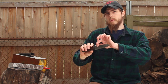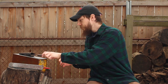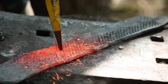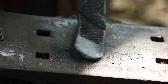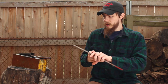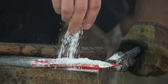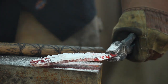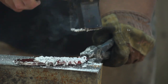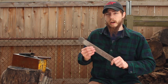This particular knife I forged out of the scrap steel from my kitchen machete video. With that rasp, I cut it off about here, the last four or five inches, and that's what I used for making this knife. As I get into the forging, I put some borax down on the teeth to try to forge-weld those shut, or at least prevent as much cold-shutting as I could. That's what that white powder is that you see me sprinkling on the rasp. So without further ado, we'll get the forge going and I'll show you how I made this.